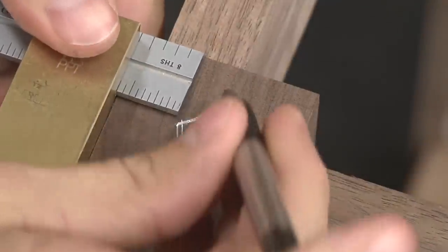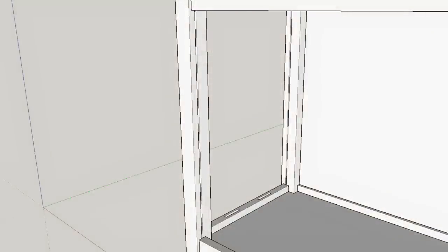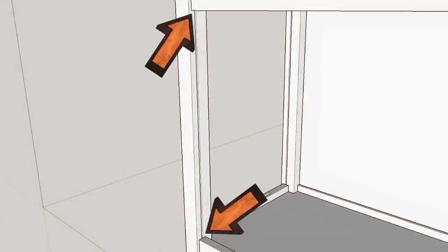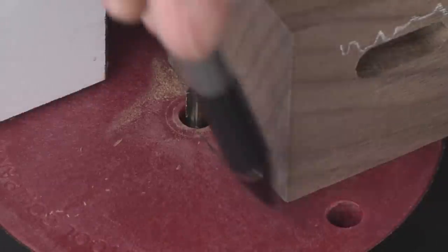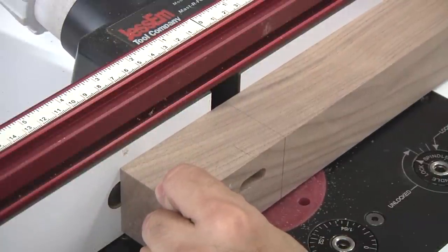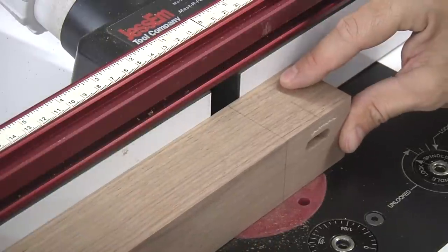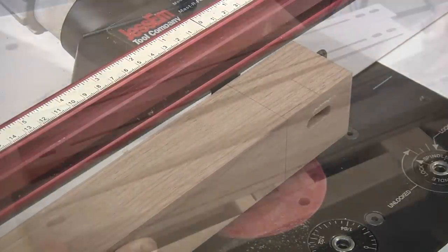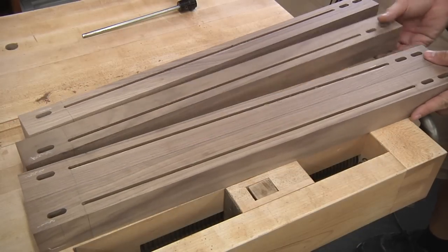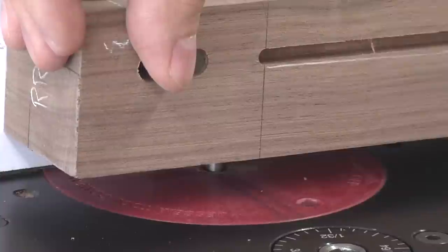The center of the rails corresponds to the center of the leg groove, so I mark those out on the top of each leg. While still assembled, I mark the locations of the top and bottom rails on each leg. This is a stopped groove, so I mark the start and stop points of the 3/16th straight bit right on the router table itself. The workpiece is then carefully dropped onto the bit, being careful to line up the line on the leg with the line on the table. Plow the groove until the other line matches up and carefully lift the workpiece off the bit. The rear legs only receive one groove, and the front legs receive two grooves.